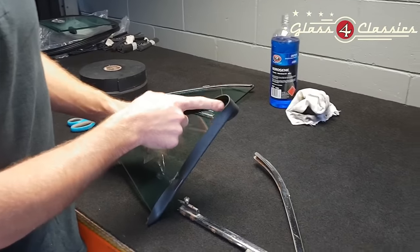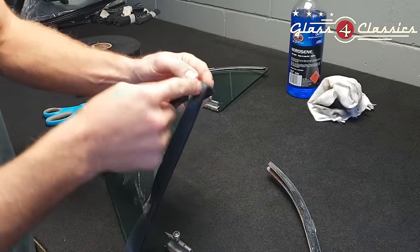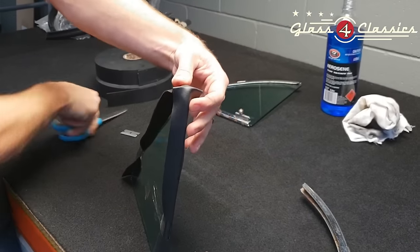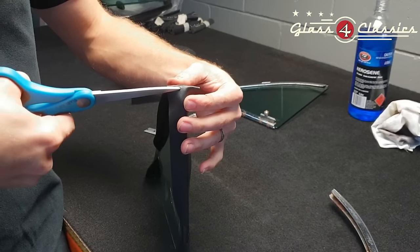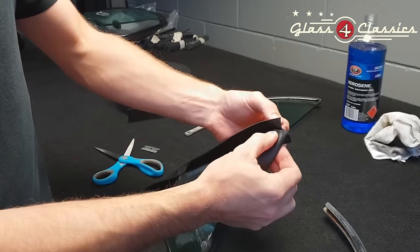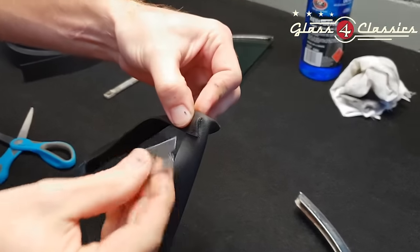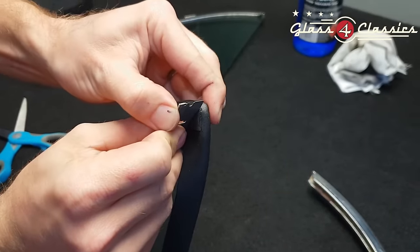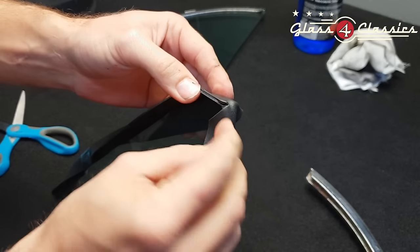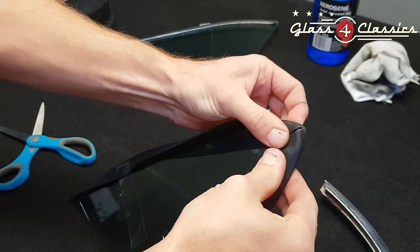Now the next task is going to be in the bottom corner here. If we leave this as it is and you try to force it in, there's too much material. So what we're going to do is fold this in half and grab the scissors and cut straight into the bottom corner, only to the point at which the glass is touching it. You're then going to fold one over the other so that they're overlapping. Then with the blade, all you're going to do is push straight down. Don't scissor it, don't saw it because you risk scratching the glass. Then remove the two bits of waste and you'll have a nice clean join down the center.